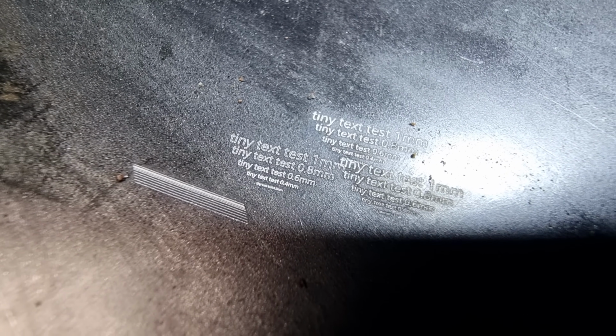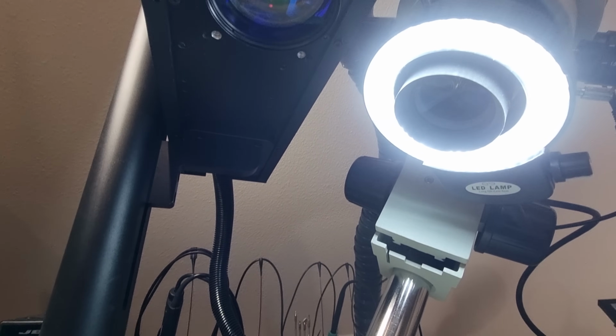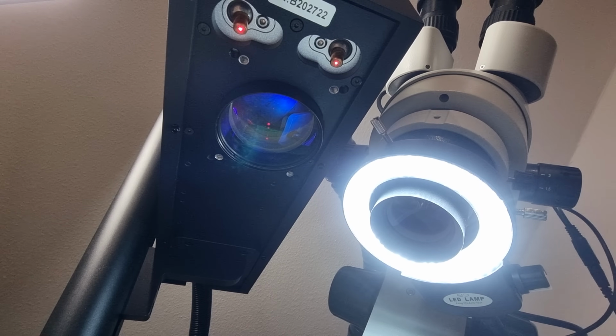I wanted to try and fine-tune the minimal spot size even further, and realign the 3 red dots on that height. But it turned out that the factory setting was already optimal, and over roughly 2 turns of the Z-axis lead screw there are practically no changes in the spot size diameter. So this is as good as it gets, and that is very good indeed.